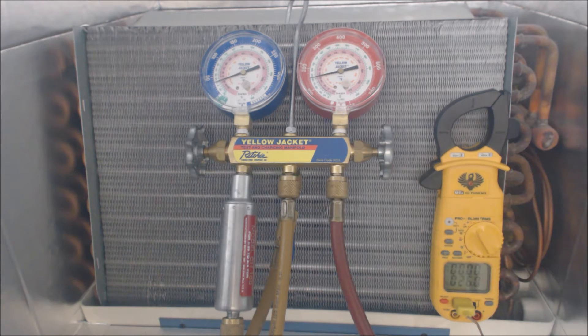Right now we have nine degrees saturated temperature on the evaporator coil and 25 degrees actual out at the condensing unit. The reality is that we really don't have much superheat even though it says we do — we're losing it. We have liquid getting back to that compressor. The only way you have superheat is with an absorption of heat, and we don't really have any absorption of heat when we have frosting building on our fins and copper lines.